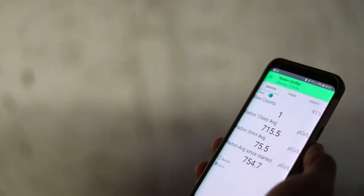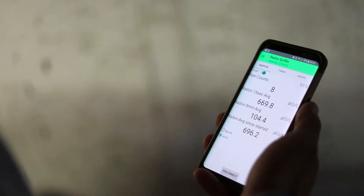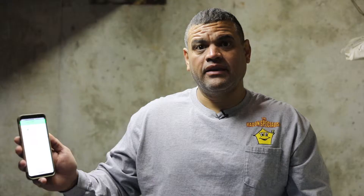For advanced diagnostics we use what we call a sniffer, which gives you radon levels immediately. We take readings straight from the soil — you can hear the beeping as it keeps spiking. We did one earlier and it got up to roughly 250–275, giving an average over about a minute or two to show where the hot spots are coming from. Without grab samples you're guessing on installation. One side of the house read around 273 and the other spiked to almost a thousand, so that side is significantly higher.